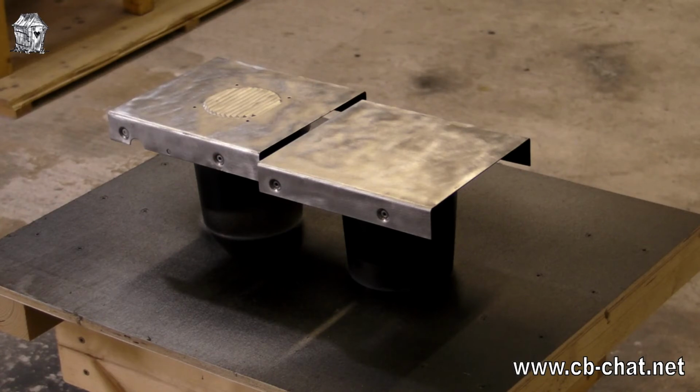And then after that it was a bowl of warm water with a spot of Fairy Liquid to remove any little bits of grease. After that I've only handled the metalwork by holding it with a kitchen towel, so I've avoided any contact with my fingers. Hopefully then it's nice and clear of grease, and nice and clear of paint, and I'm now going to give it three light coats of Hammerite black. Three light coats at 15-minute intervals.